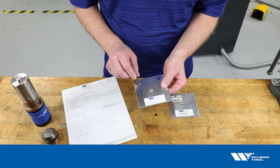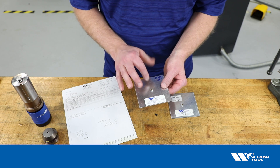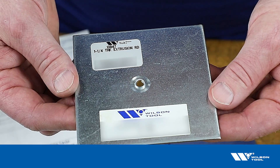If we go the other direction and use a larger pre-punch, we'd find that the extrusion height gets lower. The inside diameter is going to stay the same, but the height will get lower — and that's what this sample is showing with a larger pre-punch.